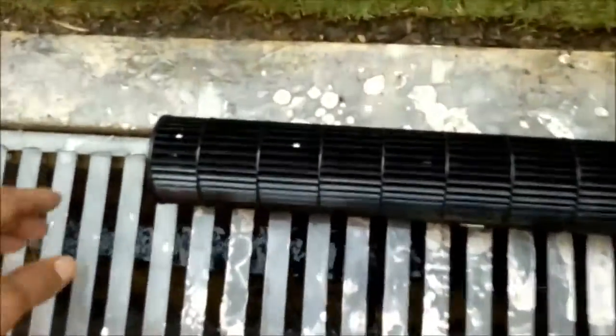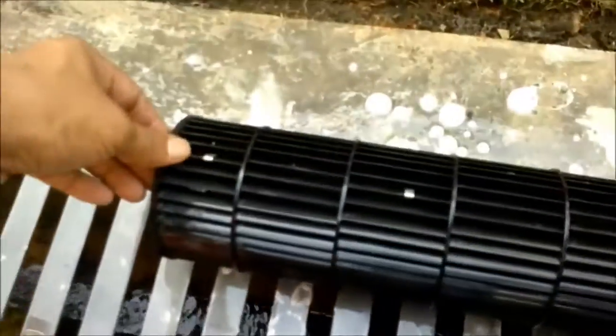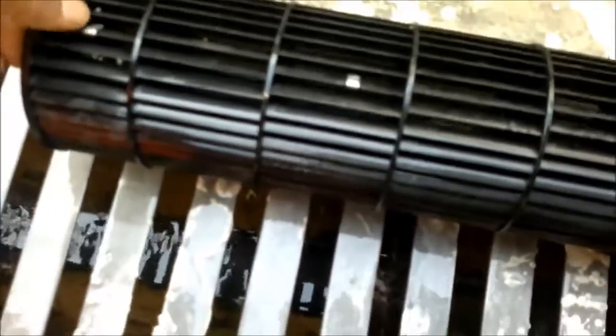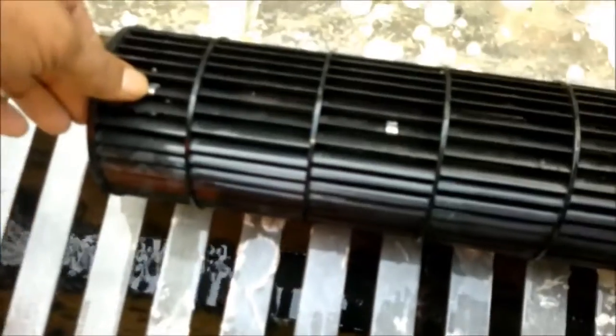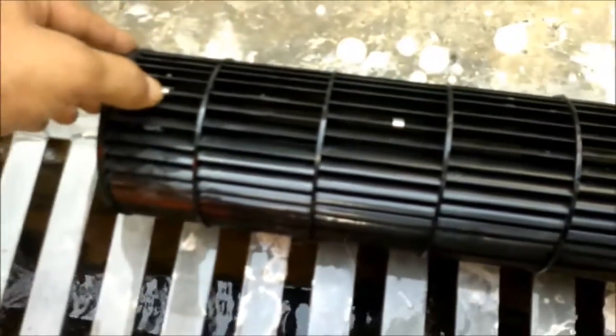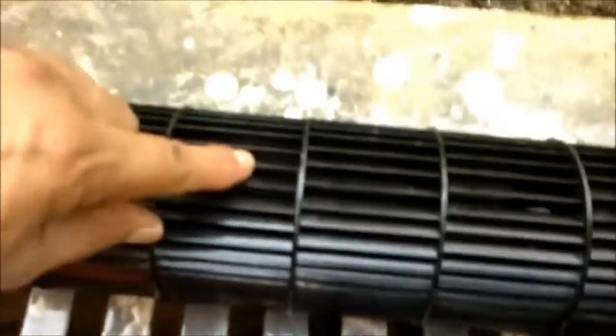Okay, regarding the turbine blade, again here, just make sure that you do not scrub off all this white metal tips. These are all meant for balancing the whole contraption here, so make sure that you do not dislocate them in any way, right? There are 2 here and there's another one here, otherwise the blade will go off balance. So you're satisfied that it's clean, right?